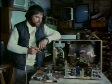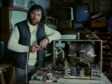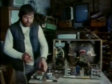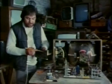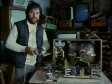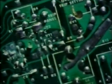When a repairman repairs your telly, some of the faults are blatantly obvious as soon as he takes the back off. Components are either burnt out or been smoking, and you can actually smell the pungent smell from some of the components burning. Other faults are fairly obvious, like dry joints on the solder — that's when the solder hasn't flowed properly onto the component on the circuit boards. Although the circuit looks really complicated, it can be likened to a road map of the British Isles. If you were travelling between London and Brighton, you're not really worried about what the roads are doing around Glasgow and Edinburgh. The same applies to a TV set — like reading a map, you can soon find the area you're interested in without detailed knowledge of the circuit boards.